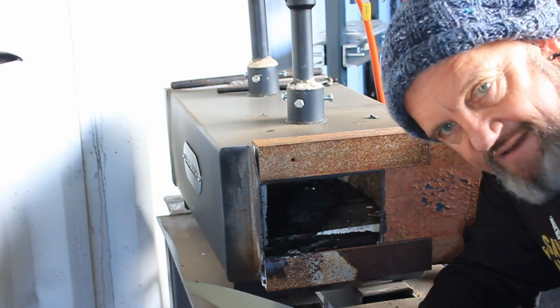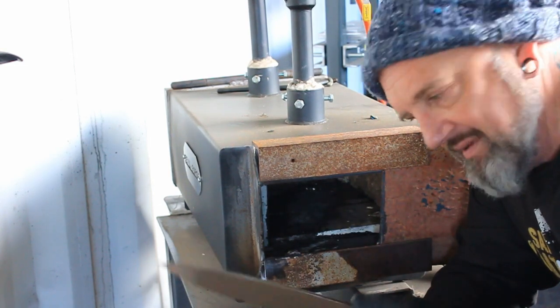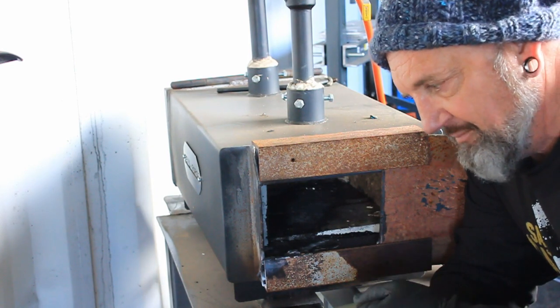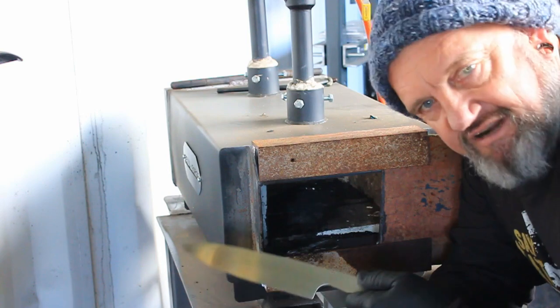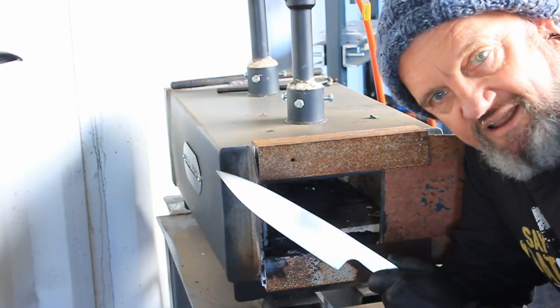And I'd say do that twice before you then heat it a third time and then give it the quench to harden it. So we're just turning the steel back into one piece of steel rather than three pieces that we're welding together. So that's the theory behind normalisation.